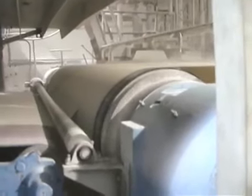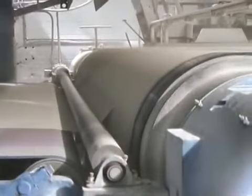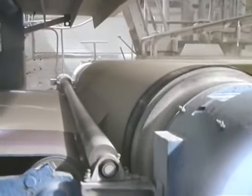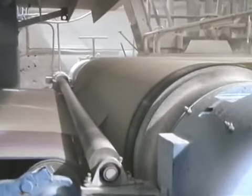Here what you're looking at is the transition from the wet end of the machine to the dry end of the machine. This is where the rubber meets the road — this is where the pulp slurry actually turns into paper. At the beginning of the wet end of the machine, the paper was a little bit more than 98% water. Here, the paper is now about 78% water and it's going into the dryer section of the machine.